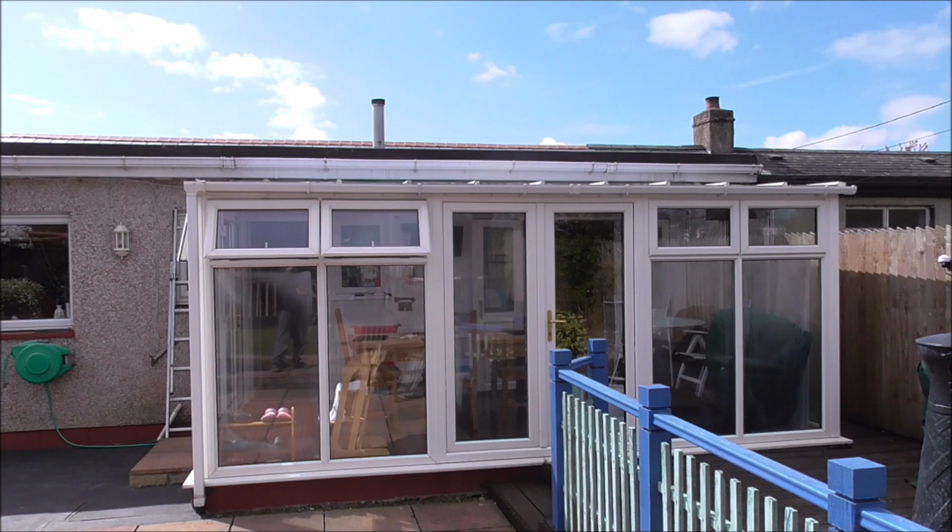I'm gonna raise this front wall up 100 mil with timber, so it's got a solid support to go across it. That'll help the strength of it as well. And raise the back right up to the eaves of the gutter, giving me the same pitch that I've got now, possibly a little bit more. But the main purpose of that is on the inside, I'll be able to put an additional plastic false ceiling in there, so that I can then put lights in anywhere I want. Because the ceiling that's going in, you can't penetrate it and you don't want it because it's insulated.